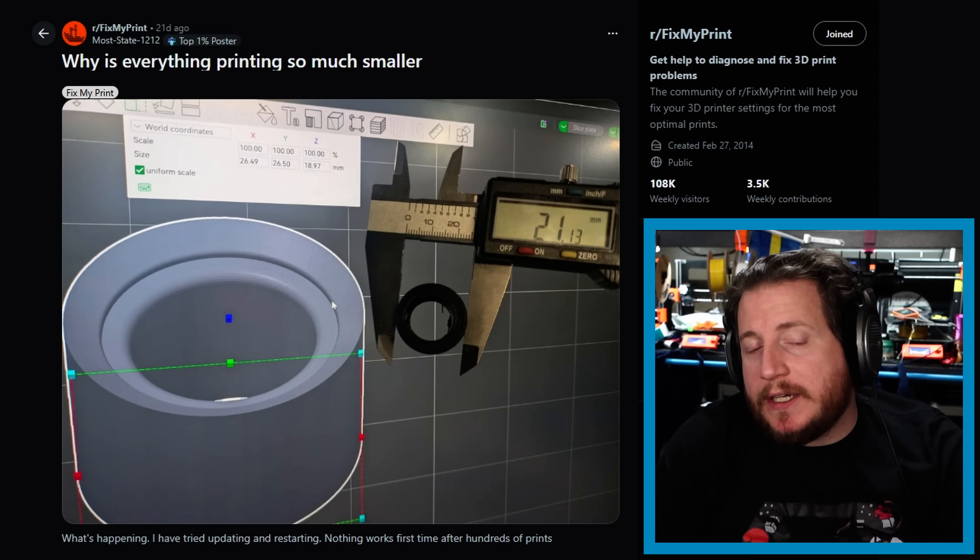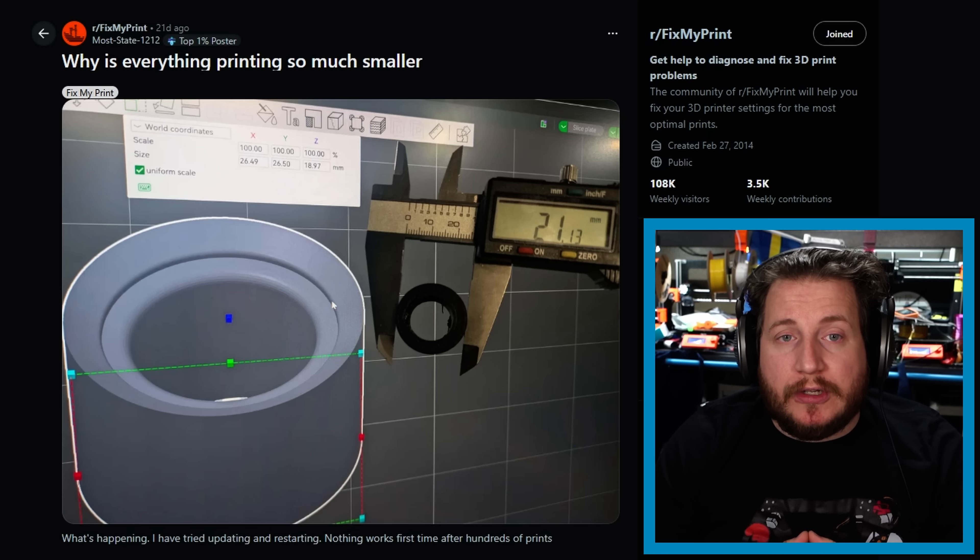This is one of those cases where it wasn't the machine. We expect some level of tolerance with 3D printing, but not five millimeters worth. A quarter of a millimeter is generally expected tolerance for modern 3D printers at fast speeds. You can dial them in to get down to 50 microns (0.05mm), especially at slower speeds. It's always good to make sure your calipers are calibrated — have a test subject with a known diameter on hand as an idiot check.